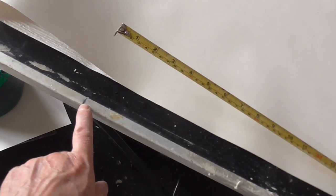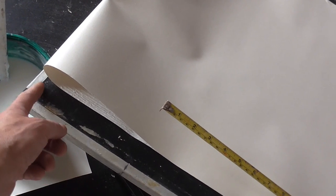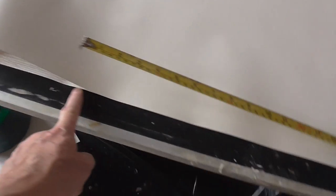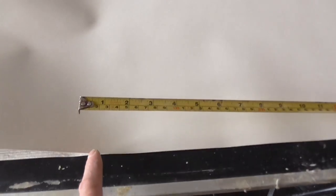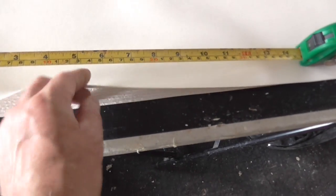What I usually do is I cut it off, probably about where the damage stops — you can see where the pattern's flat there. Because usually you end up not using the end, so you might as well waste the beginning. I've measured my first piece and I want an inch and a half top and bottom for trimming. I've started off my paper on the edge, come down to the six-foot mark, fold it back, and I want seven foot five inches — that's where I'm going to cut the paper.